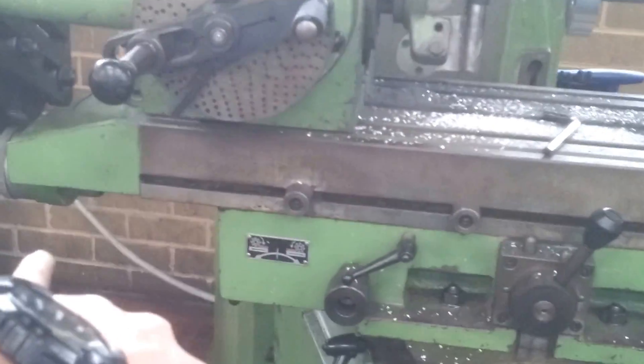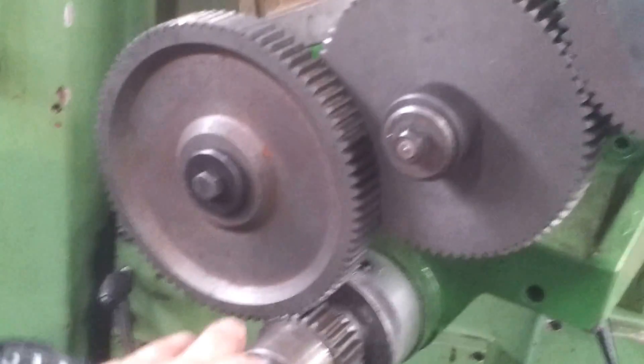The table is swung over on the left hand side. We looked up our chart and came up with the gear ratios, number of teeth, back up through here and the input into the extension housing on the dividing head. We're using a 33 hole plate, and we're doing 30 holes on a 33 hole plate — how many teeth? 44 teeth.